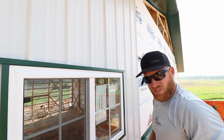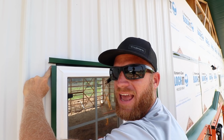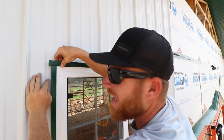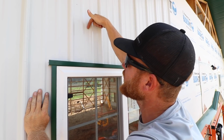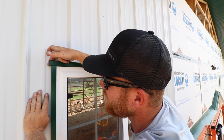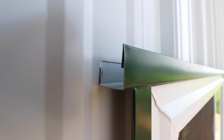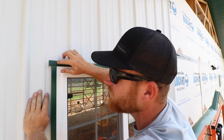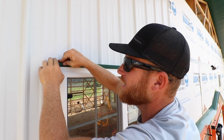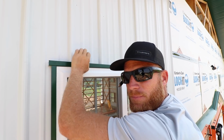And that's it. But did you see that right here? So you can see now I have my steel up, but I'm gonna take this J channel, which is nice and tight, and I'm gonna go over it. Now all the water that comes down into that J channel is gonna run out here, and it's gonna go over the steel. It's not gonna get right into this corner where I see a lot of guys will 45 this piece of trim. Yeah, it might look good, 45s are great, but this helps you stay watertight. And now we'll run some screws here to keep this nice and tight, and water's gonna hit the top of this J channel and be gone.